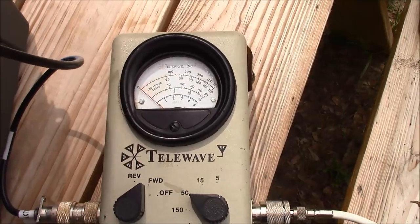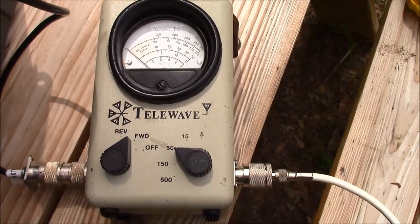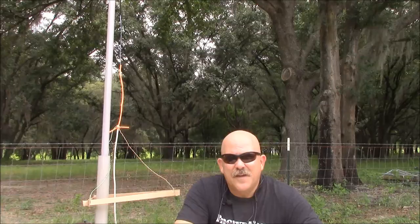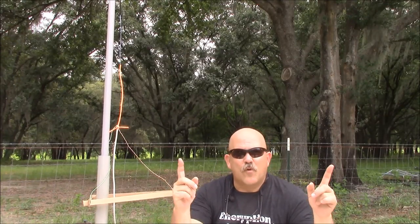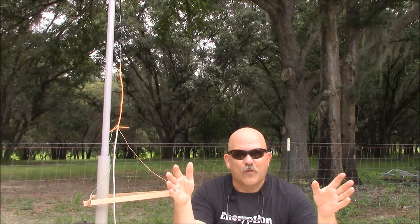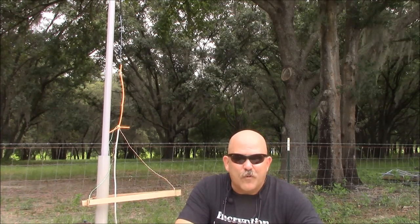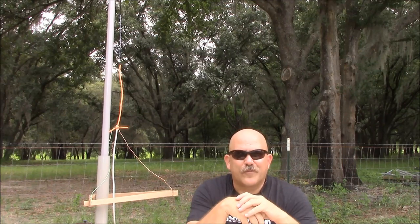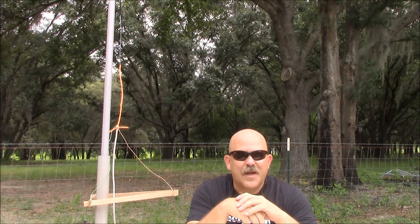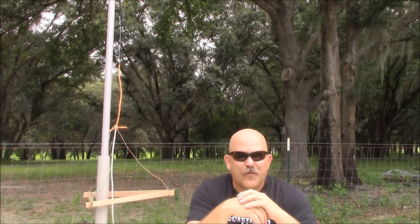We have no complaints about the resonance of our antenna on the two-meter amateur band. We cut the elements 20 inches — a little long — and that puts us almost perfect at 146 MHz. Testing under power with an Astro Spectra around 146 MHz, forward power is about 43 watts and reverse power barely registers. In review: we took a 20-inch section of Category 5 network cable and constructed a ground plane antenna interfaced to 50 ohm RF feed line. You can have the most awesome resources in storage, but they don't help if you don't have them with you. What you carry on your body and upstairs in your mind is what will carry the day. This is Brett from Survival Comms — till next time.